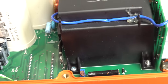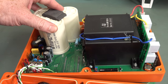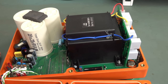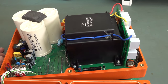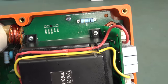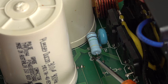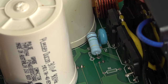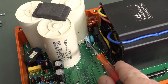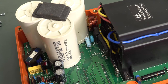These are usually pulsed DC type things — I'm sure there are many different standards for them. It doesn't give you continuous DC shock; it actually pulses. That's why you need pulse grade capacitors on input and output. It's got some sort of feedback to regulate that. And what's that resistor up there — is that a bleed resistor or a feedback component? If you look down in there it says HTFB — that would be high-tension feedback. So that's feeding back from the secondary side, or maybe there's an intermediate step-up before the big transformer.